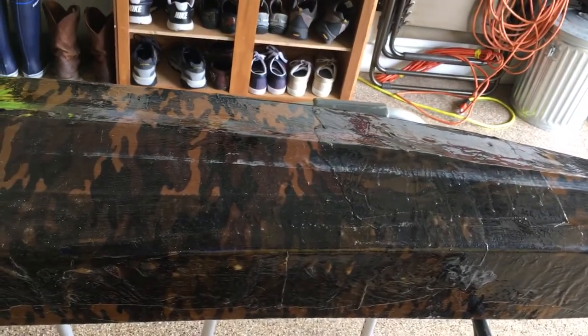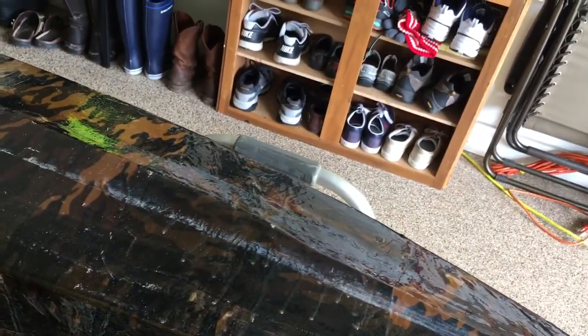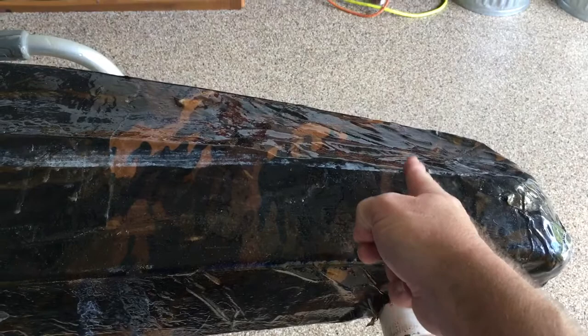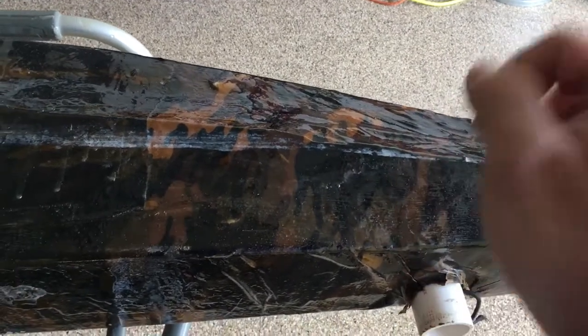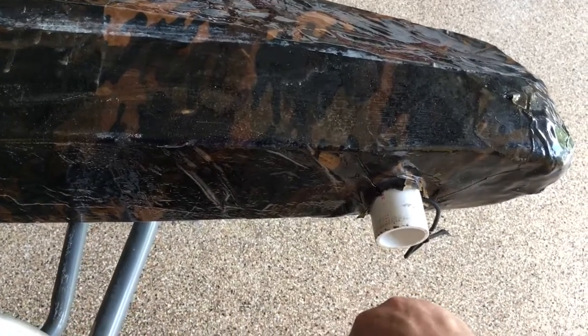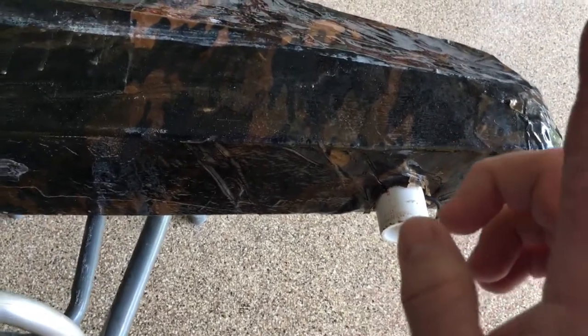This is a simple PVC T inside here that is glued with some little nipples — short pieces of PVC — glued inside there with epoxy. The T runs this way and then out this way. I forget how long this is, probably five or six inches. You can make them longer and just cut them off with a hacksaw. Make them about this long because you don't know how long you need them. I glued all four of them in there with epoxy.